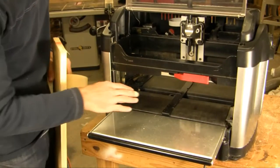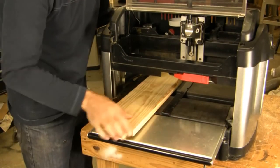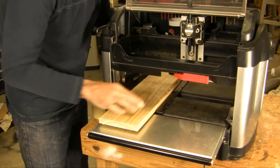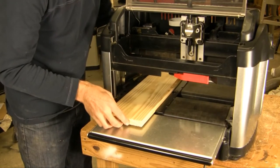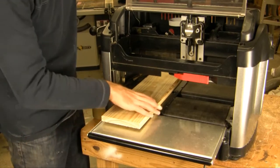You also want to make sure that your board is not getting wedged as it goes in and out. If it binds, it can stop the piece of wood and cause it to slip against a belt, which would give you a tracking roller error as well.